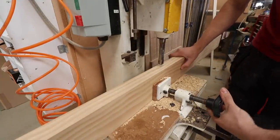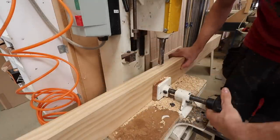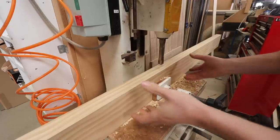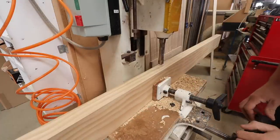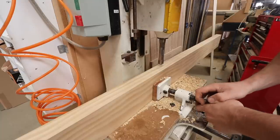As you slide a piece of timber along, you want to make sure that no timber or wood chips fall down the back against the fence and move the position of this mortise. That'll be where any inaccuracy comes and steps in your shoulders and your joints.